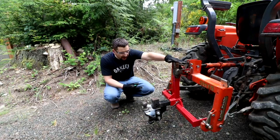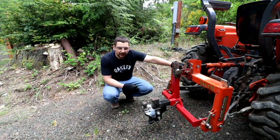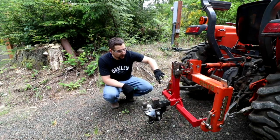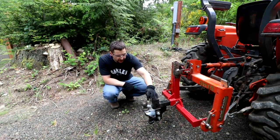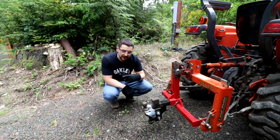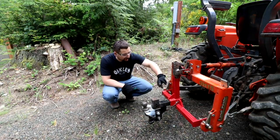I ended up cutting it with my plasma cutter, washed out the welds, and reused the existing ears. I started with some old 6011 stick rod that didn't work well, then switched over to 7018 which burned in nicely. Used a pneumatic needle gun to clean off the slag — just a little faster. Had to adjust some bushings to make this work with the quick attach. You can check out the link in the description — the ball is a two and five-sixteenths, which fits all three of the trailers I own, so it will just stay on permanently. Honestly, I've never used one of these on the tractor before — I just used a front loader and a ball, which really didn't work well. This worked incredibly well and I'm really happy I purchased this adapter.